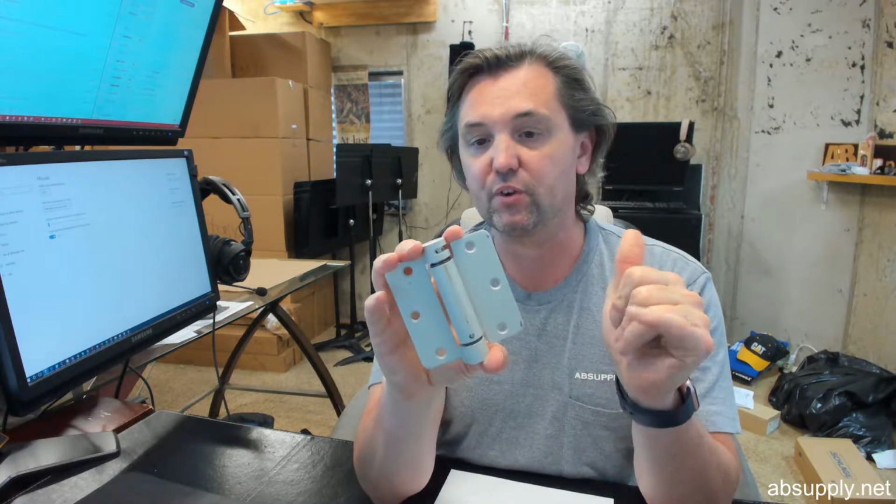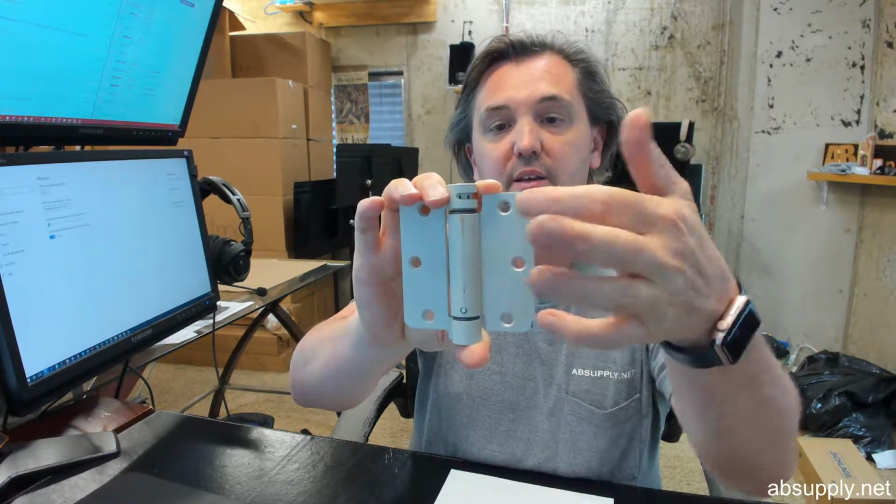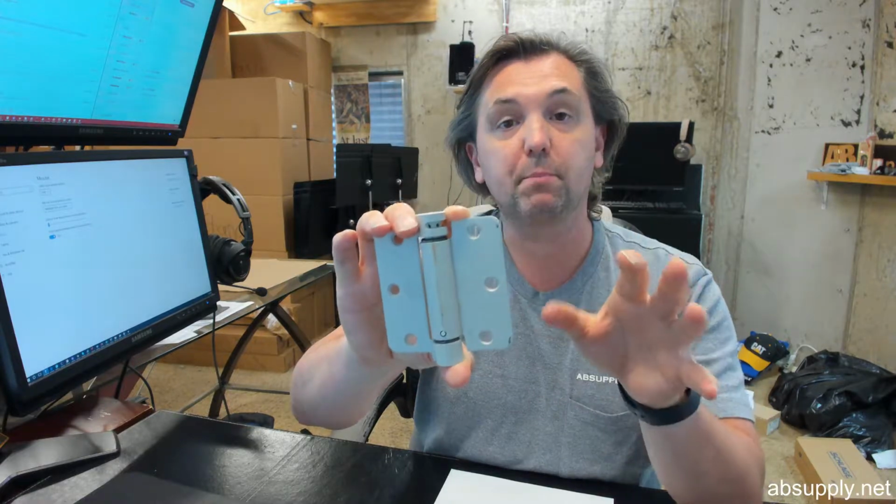And the LB4311C, all of that conspires to mean that it's a single acting spring hinge, and they're LB or lube bearing construction. The 4311C refers to the fact that it's a commercial grade hinge. It's 130 thousandths. That it will have a 1/4 inch radius and 3 holes in a template pattern.